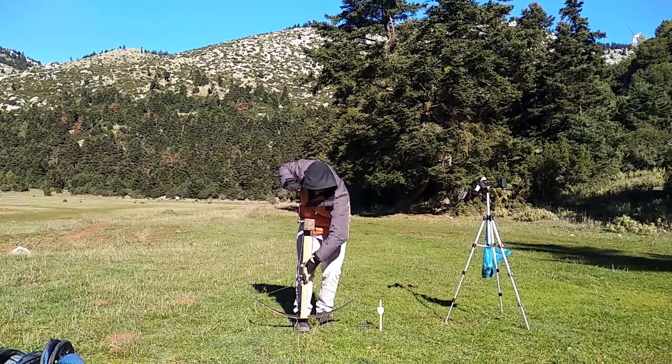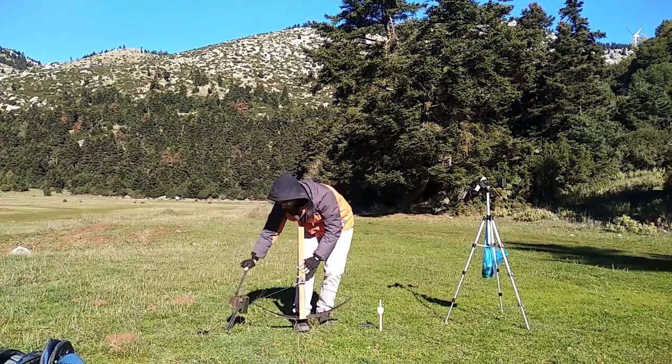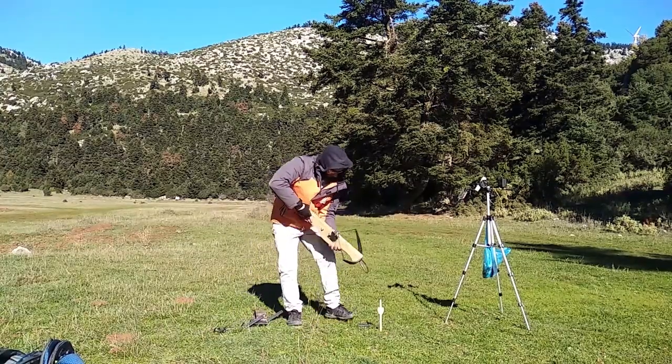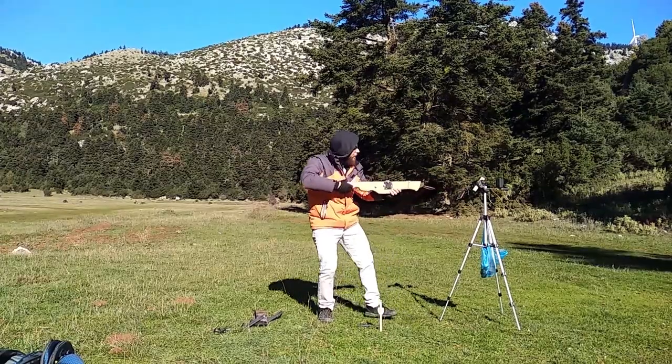This Crossbow could operate faster with a goat's foot lever, but the steel winch was easier to make. I made the prod tilted forwards to avoid friction of the bowstring on the stock, but I should make it to a lesser degree because it seems to push the projectile's tail up.